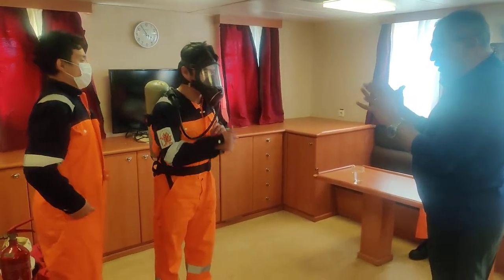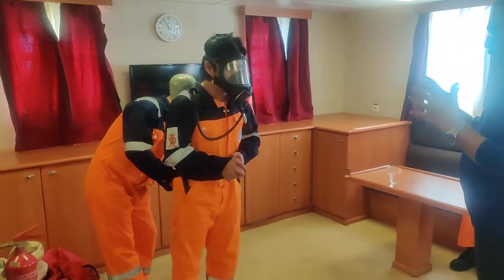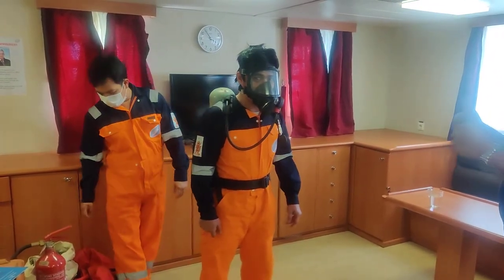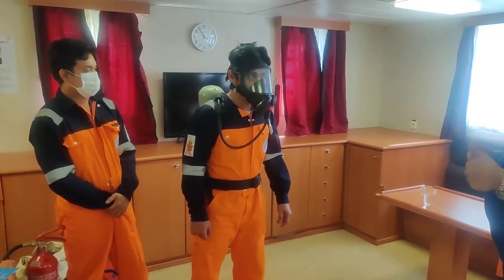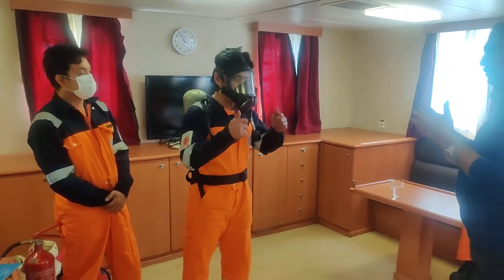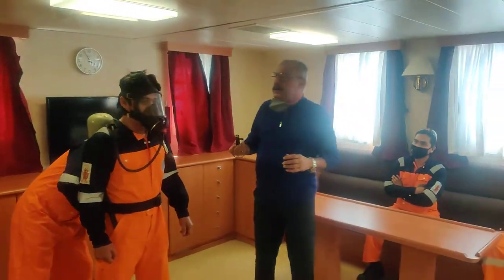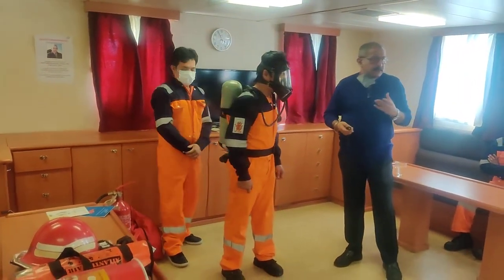Now wait. You stay there. You're okay? Now you close the valve. Close valve. Okay? You will feel the mask will have a tendency to collapse on your face. Just give a thumbs up. You getting that? You will have a tendency of the mask collapsing on your face. Open there. So that means the face mask is fully gas-tight on the face.